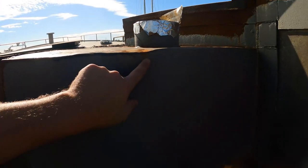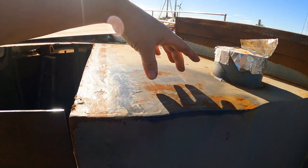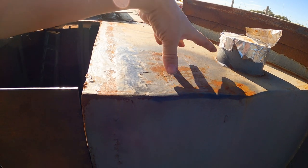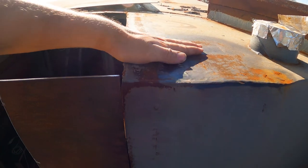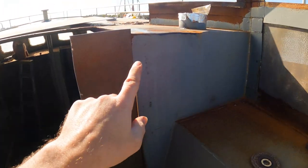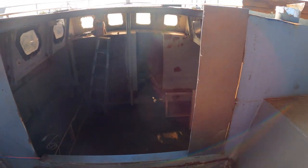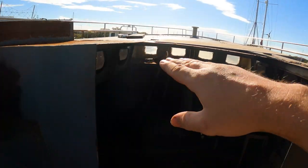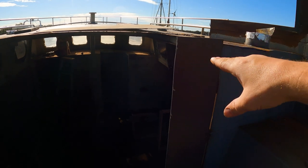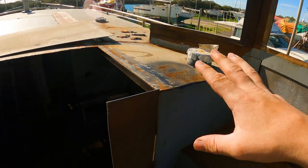As you can see here we've got some divots on this top plate. I've already welded up a plate - there was a big corrosion hole here so I've welded that up already. But this top plate needs to come up two centimeters, and that will make it the same height as the other plate. It's 710 millimeters from the top to the bottom of the companionway on one side, and 690 millimeters on the other side. I want to make everything symmetrical and cut that plate out, put a new plate on top, and make that whole area look a lot better.